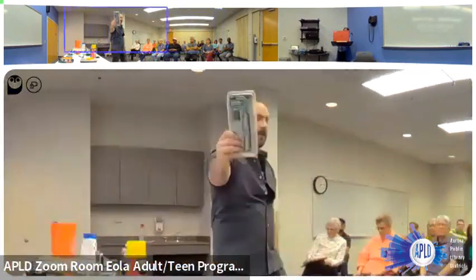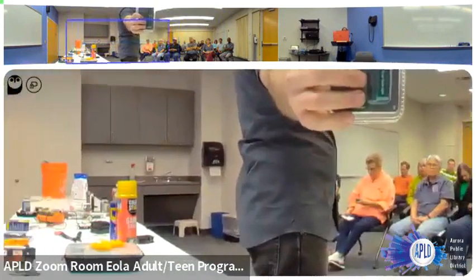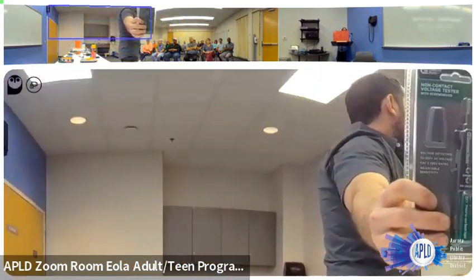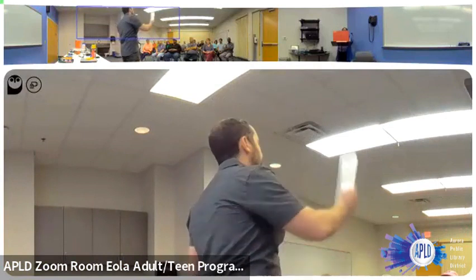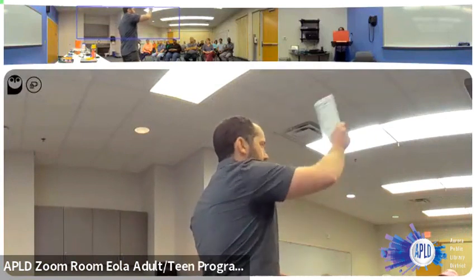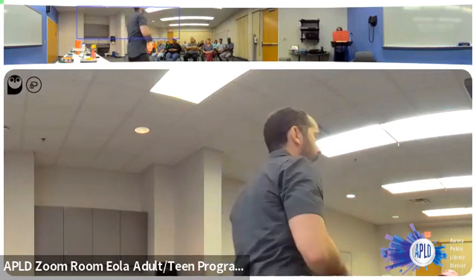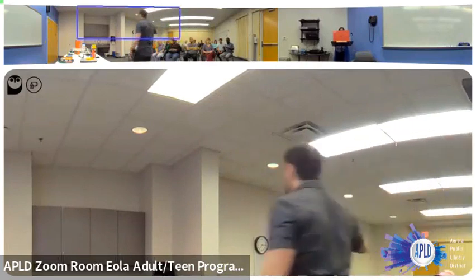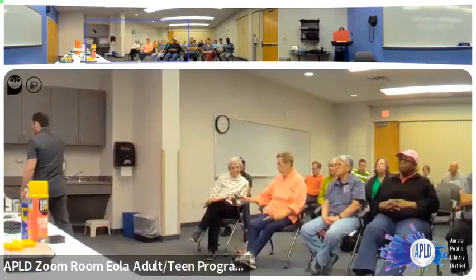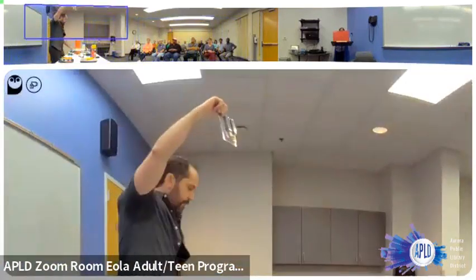Non-contact voltage detector, okay? So that if you slip with your screwdriver and cut that insulation, you don't get hurt, okay? Because you're not allowed to work on anything live. This will assure you that everything in the box is off. So when this stops beeping, that's when you can stop turning off breakers. Now, yeah, I'm going to pass this one too. The other thing, if you're working on a light or a switch, you should have one of these, okay?